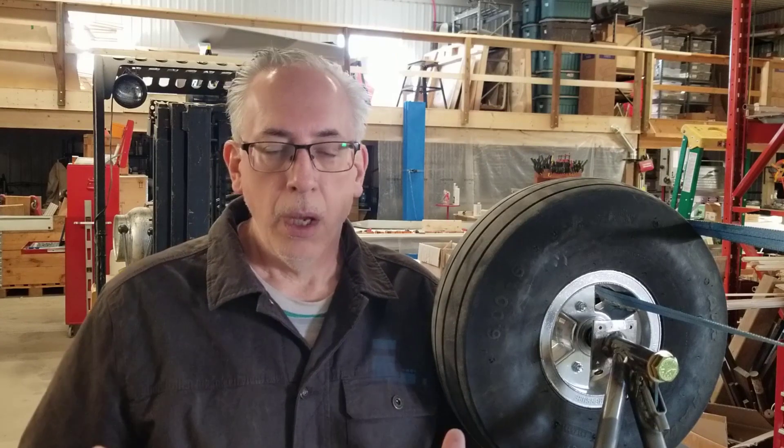We have designed it to have just a little bit of inboard angle so that when the weight of the aircraft is at gross, it'll bring the wheels down to vertical. I'm super pleased that this has come through — we're now going to be able to start manufacturing them and shipping them to our customers. The system is generic enough that it will go on any aircraft, so we're going to be offering it as a system for sale on our website.